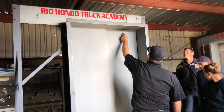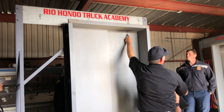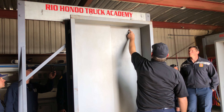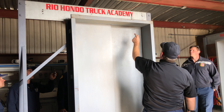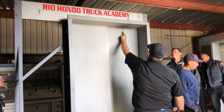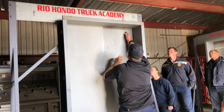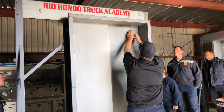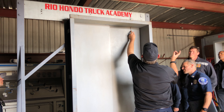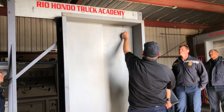I'm going to go towards the opening. First thing that I hit should be that locking arm. From the pictures and what you just saw, that locking arm is flat stock material — about half an inch wide. So I'm going to bump it, then I turn my tool and come around it and back on it. You should be able to tell yourself, yeah, that's about half an inch. If I kept going, I would hit that wheel, and that wheel is four, five, six inches wide — there's a lot of body to it that you wouldn't be able to twist your tool back around. So I come back on the locking arm, on the opening side of the locking arm where I want to be.